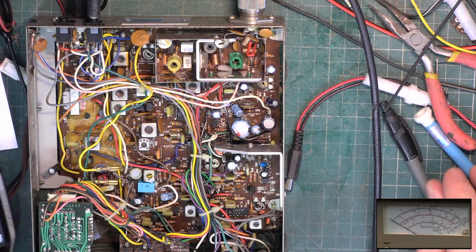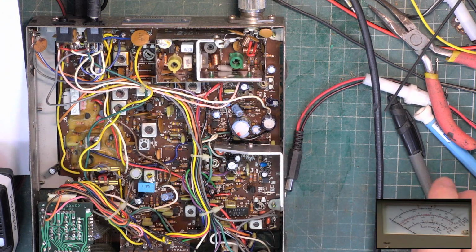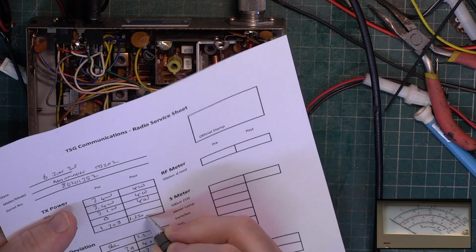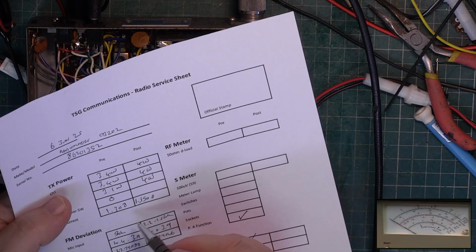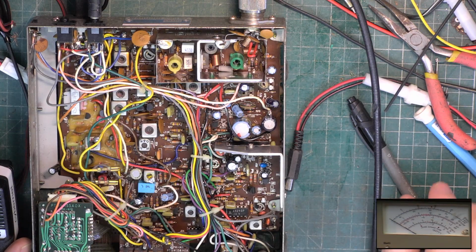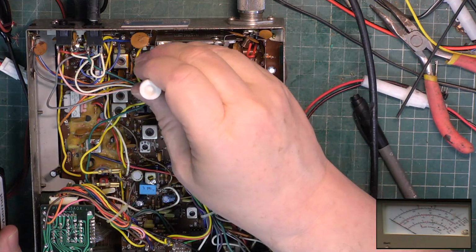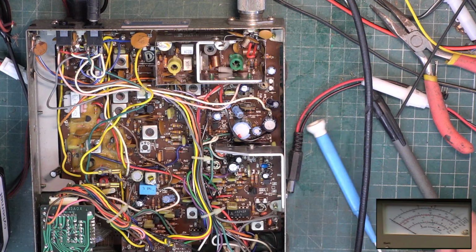Right, low power. Oh no, before I do that, make sure we're back on channel 20. Current consumption is now 1.35. So it has gone up a fraction, 1.350 amps. So for half a watt more, it's gone up 10 milliamps, hasn't it? Which is good. Low power, see if we can just do that. Have we got a broken preset? No. 400 milliwatts, there we go.